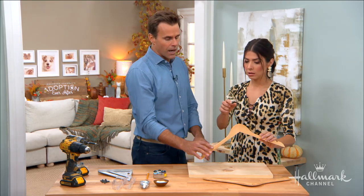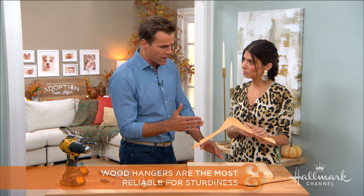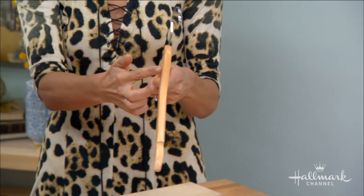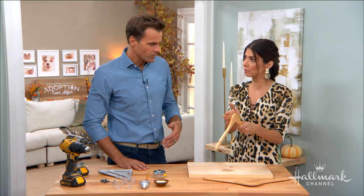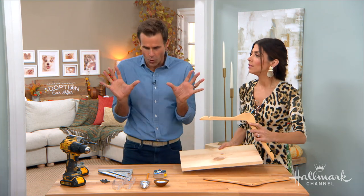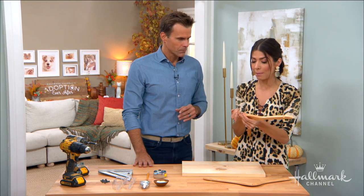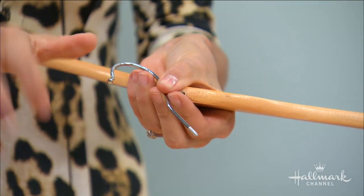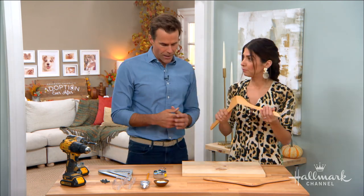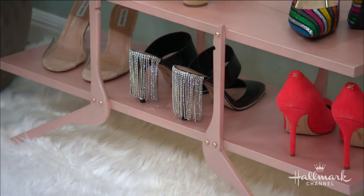We've got to get to actually attaching these hangers. You said wood hangers, and you're going to tell us how to take the hook off. The hangers have a little curve to them. The side of the hanger that curves outward is what we are going to put against the wood — it's actually going to get drilled into the wood this way, so it's kind of curving away from the project. It is a screw, so you can see the actual grooves in there. You just take some time, pull and unscrew at the same time, and eventually it'll just pop right out. Once you've got it ready, you need to figure out how it orients on top of the wood. These little rounded bottoms are our base.